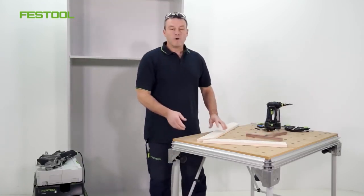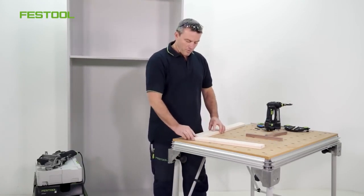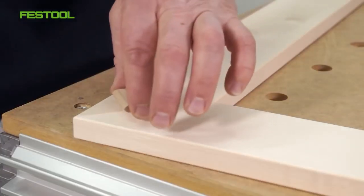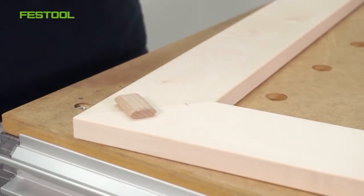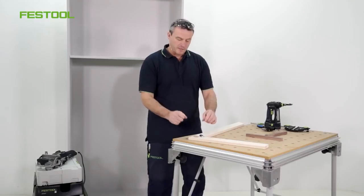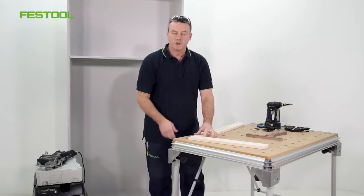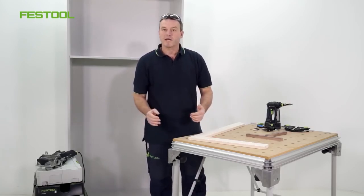It's also an excellent gluing aid. I'll proceed as follows: I'll put these two parts together, I'll certainly want to put a fixed dowel into position, and insert the connector. At a later stage, I can use a screwdriver on the connector to pull the workpieces together. I made two markings earlier, just directly on the workpiece, because otherwise there are no reference points for working with my stops.